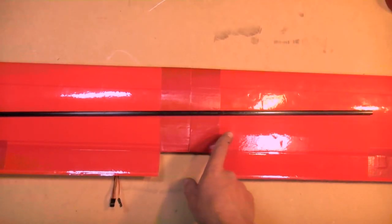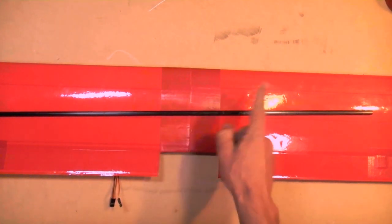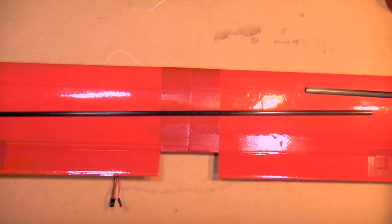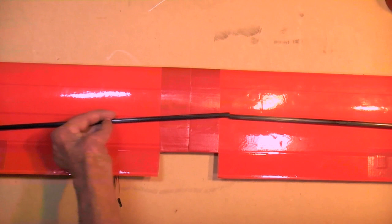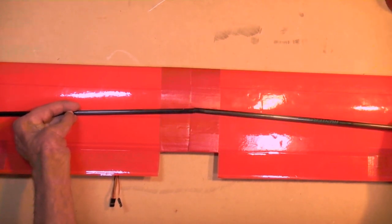So then the process of breaking down this wing, if you can imagine, this spar is on the inside of the wing, equal parts, 15 inches on the right, 15 inches on the left, and you'll take your second one, and then by approaching from the opposite end, you're pushing that until the place where they meet is directly over your hinge, and that way they will come apart at the hinge.